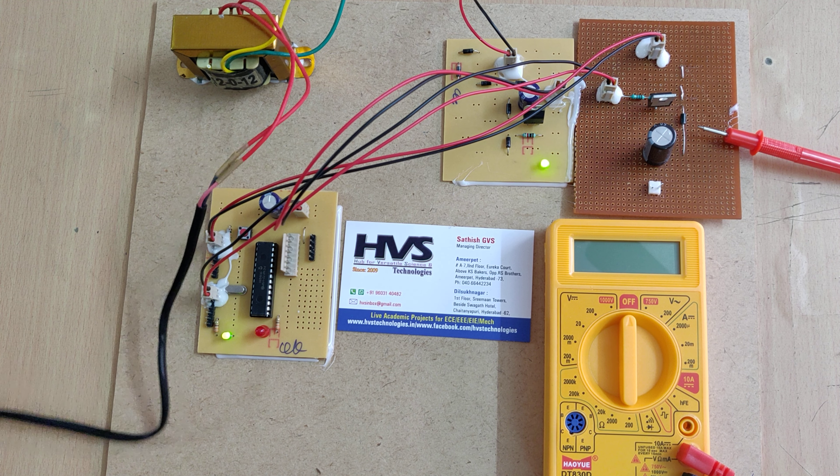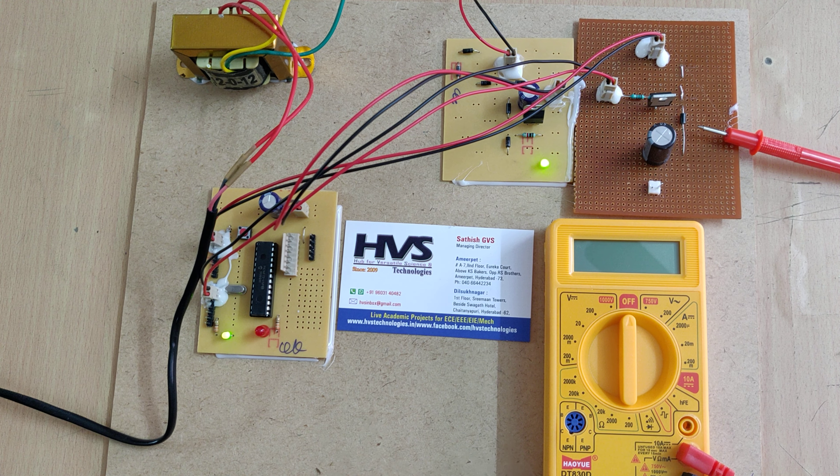Based on the PWM signal — the pulse width modulation on and off time — the capacitor charges rapidly and the inductor discharges rapidly. We get V1 plus V2 because the inductor is also an energy storage device like a capacitor. It discharges whenever the MOSFET is off, and the resulting output voltage is near 12 to 15 volts depending on the input voltage.